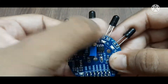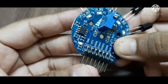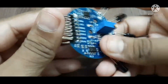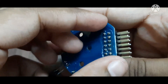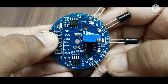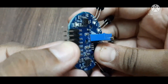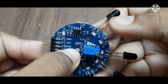The grounds of all the sensors are connected to a single pin, and the VCC is shared similarly. The ground pins and VCC pins are grouped together. There are digital pins and analog pins for all five sensors. The top layer contains the digital pins and the layer below contains the analog pins. The first layer is ground for all sensors, the second layer is VCC for all sensors, and the third layer — D5 and A5 — are the digital and analog pins of the fifth sensor.